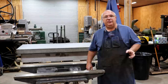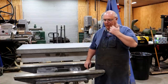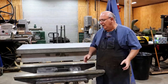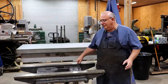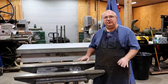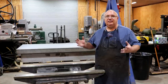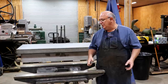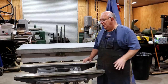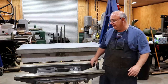Now, if you've been following along with my restoration, you know we've been doing a lot of cleaning up, painting, and inspecting the machine for wear. My goal right now is to just get the machine back up and going, not really doing a total rebuild. I had taken this complete saddle and cross slide off the machine earlier just to clean it up and inspect it, and realized it really wasn't in that bad of shape from a scraping standpoint. So I decided, as long as I've got it apart, I might as well go ahead and scrape this thing in. That way when I come back to rebuild the rest of the machine, I'll already have this done and won't have to take it completely apart again.